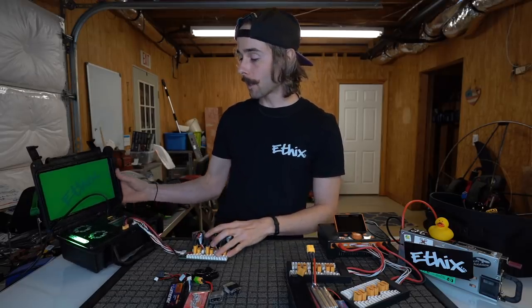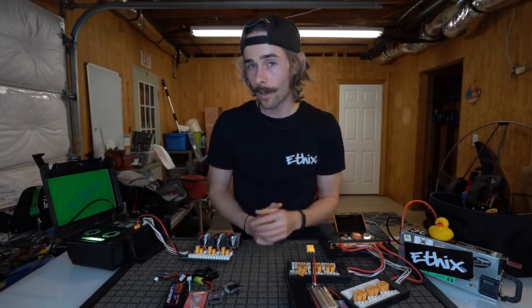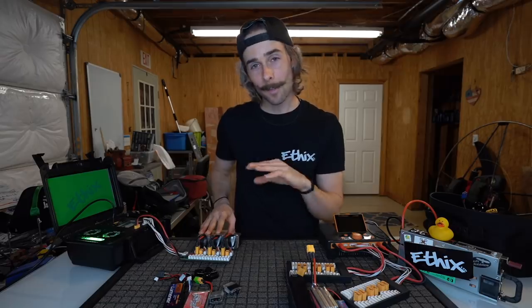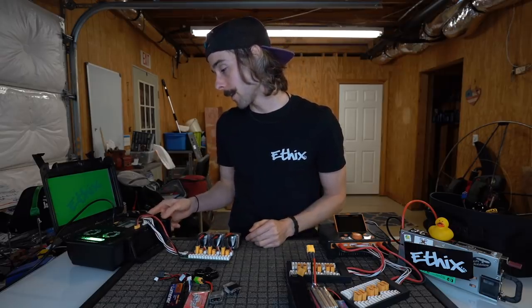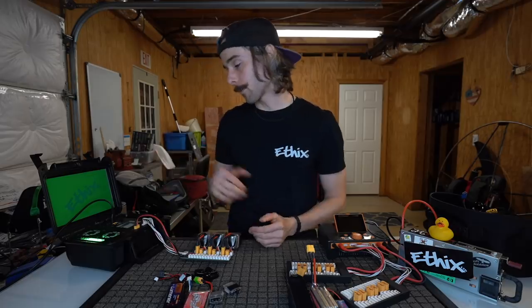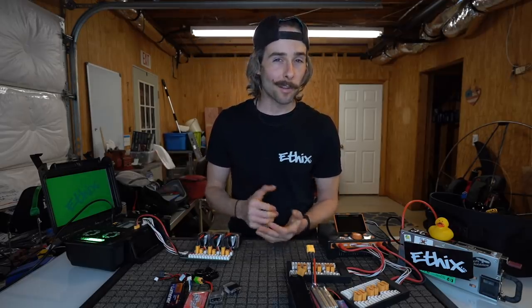Now, I'm going to charge these batteries at 1C in parallel, and that would mean charging them at 1.1 amps times 3. Because we have three of them, 1C means we're going to charge at 3.3 amps. So I pop this up and go over to set it. I know you can't see this, but I'm going to go ahead and do it. I've got it set to 3.3 amps. I'm charging it. These batteries will be done in about 45 minutes, okay?